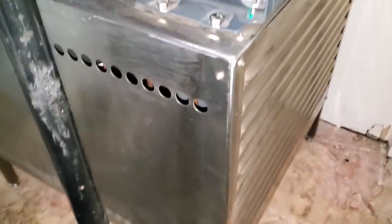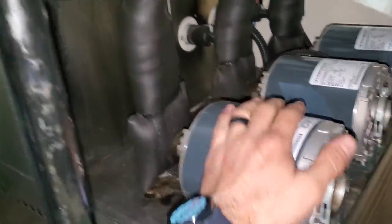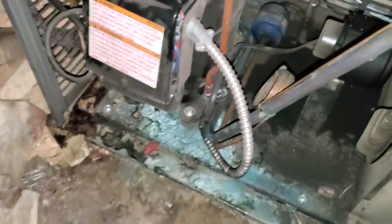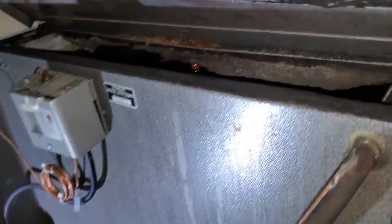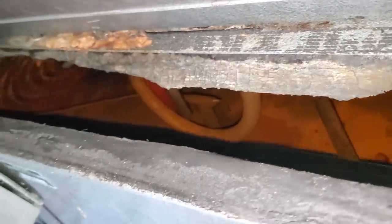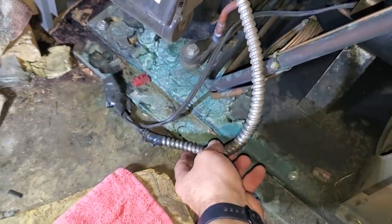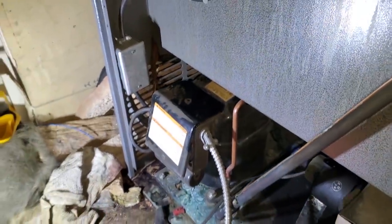We're up in a tight glycol room today. The complaint is that the beer is pouring warm out of the beer tap. We've got one glycol unit with three pumps and another glycol unit with three pumps. I would assume it's this one because it's not running. It looks like someone was in here ripping things apart. The disconnect switch looks to be on. The compressor is hot to touch, pretty hot. The condenser fan motor is also hot to touch, but doesn't appear to be locked up. There's some creative wiring going on.